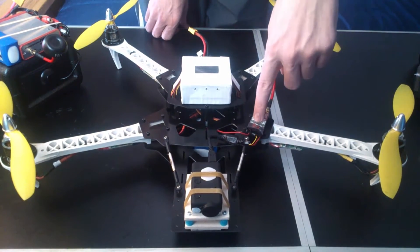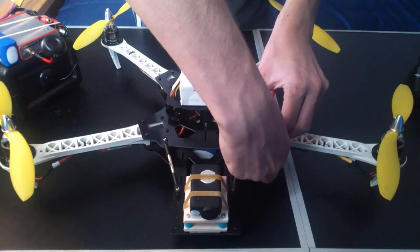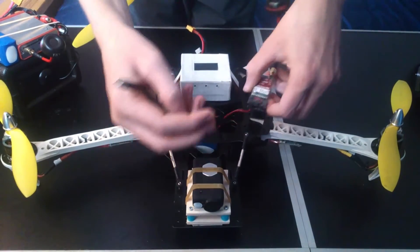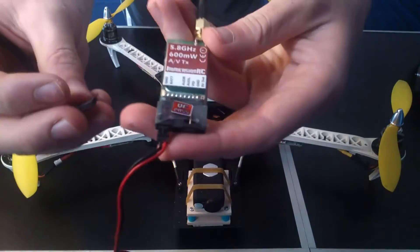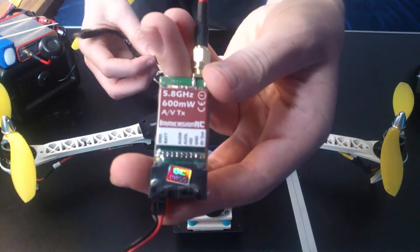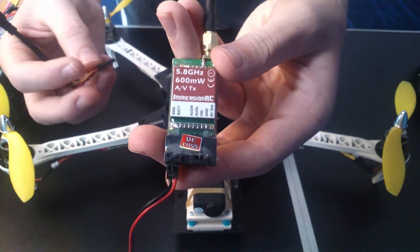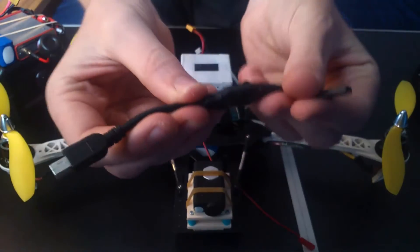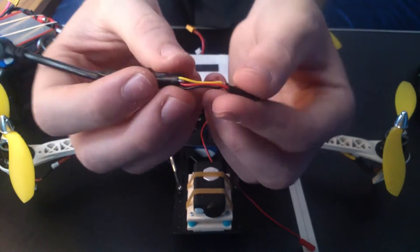From the VTX I have got the Mobius cable. I just matched that up to the transmitter. With the cable you've got on the VTX, just pull this out. On the VTX you've got the video here, then ground and then the 5V out. I actually power my Mobius with the 5V. With the Mobius cable that you get when you buy the Mobius, or you might have to buy it separately, it just came with other wires and these connectors.